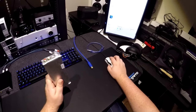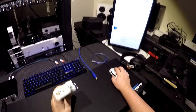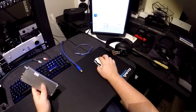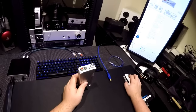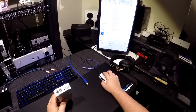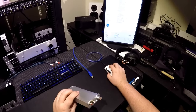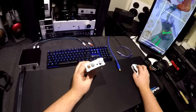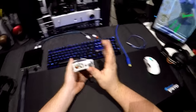Fine. The headphone output, however, the highest it goes, and I think this might be because it's Class A, but I've had other Class A things and this seems a little off. 350 milliwatts, so a third of a watt into 16R. I'm assuming that's ohms. Yes. They said R, 10% total harmonic distortion, which is a ruinous amount. But at 1/10 that power output, so 34 milliwatts into 300R, it's 0.1% total harmonic distortion, which is still a lot for a headphone amp. But I mean, they keep touting how it's Class A, so give them the benefit of the doubt, maybe? We'll get to it.